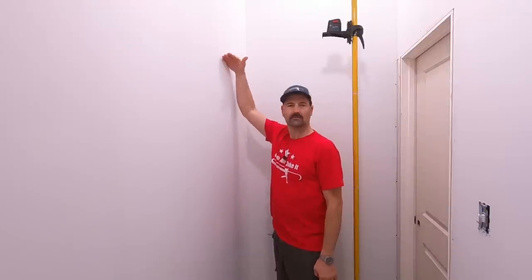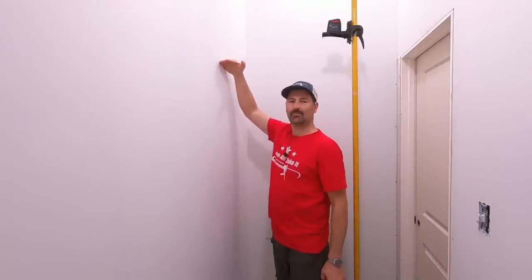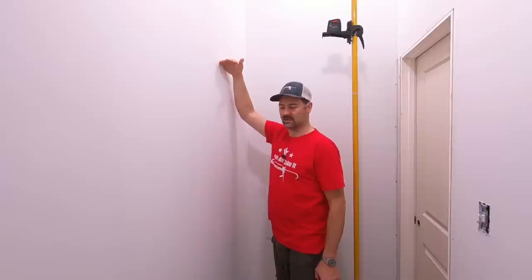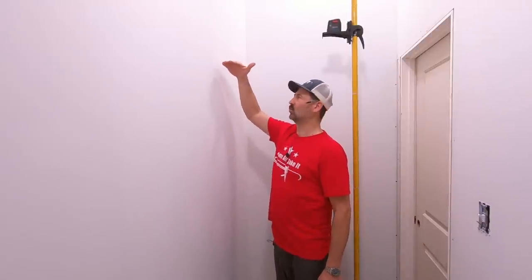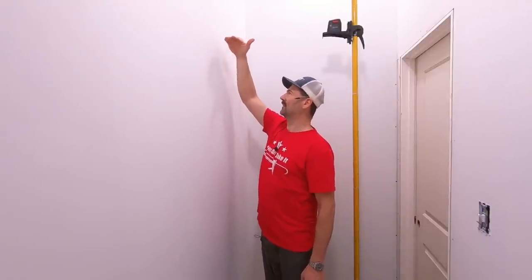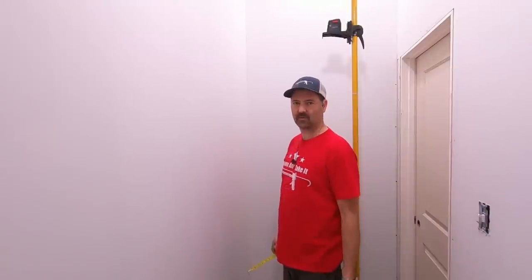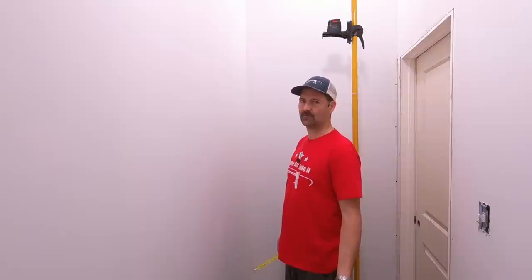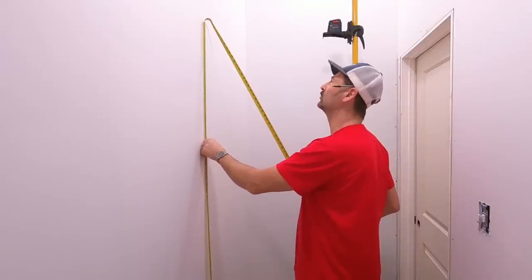So what is the height that you put your top rod at, your middle rod at? The top of the top rod is gonna be 82 inches. The top of the lower rod is gonna be 41 inches. Now I need a gap between the top rod and that first shelf. I'm gonna do that 2 inches. My legs for this system are gonna be 84 inches. Easy, even number to remember, 84 inches. That is 7 feet, and that's gonna look really, really good.